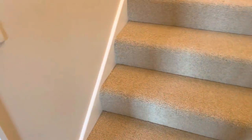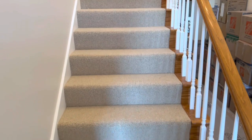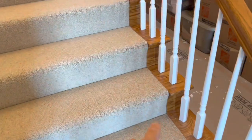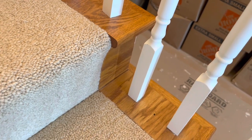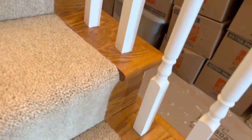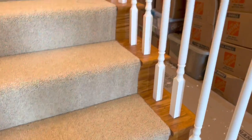Now I've got this all in there evenly - we've got a nice gully, a nice line right there. I'll take my mallet handle and rub it on the strip so that whenever I push up on my next one it's going to get a hold of them tacks and not come out. It'll be a nice pretty gully like this one right here - see this nice little gully all the way across there, nice and tight. That's what you want to end up with. All right, we got these steps all done now, everything is nice and complete. It actually turned out better than I thought - I thought it was going to be super ugly over here, although I don't like how that sticks out on the other side.